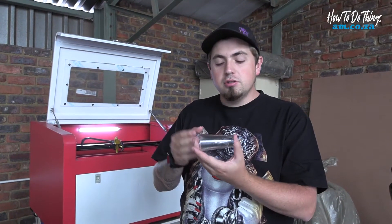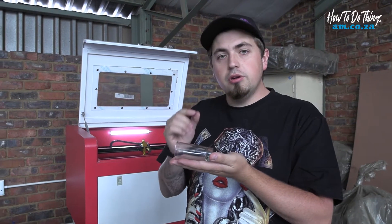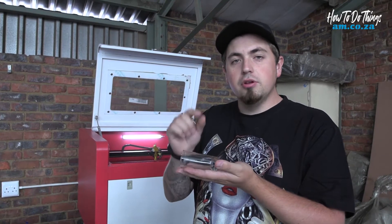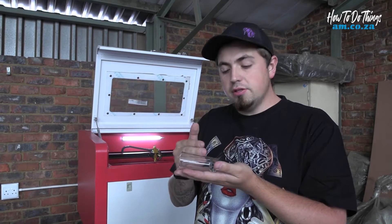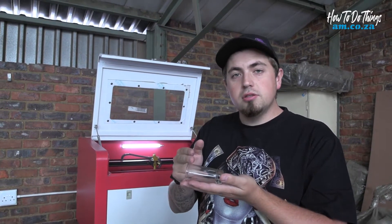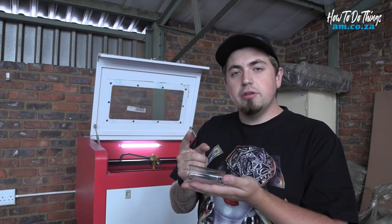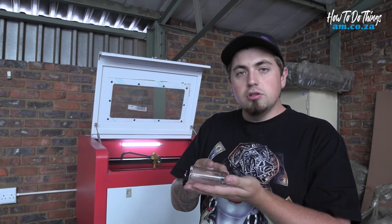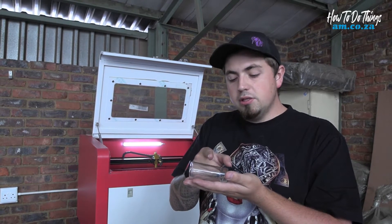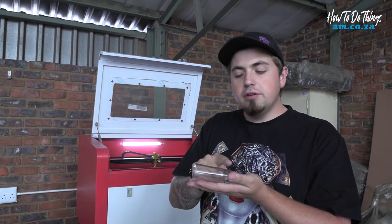Looking at this shot glass when we lay it flat, you'll have a big issue with your focal height distance. With any laser we have to have a specific height where the head sits above your piece of material that you're engraving. So what do you do when you have two different heights and you're only supposed to level your head to one? The simple method I use is level it to the middle. We've got two different ends with two different heights, and if we align our head to the middle of our glass, we compensate for both sides.